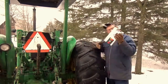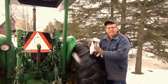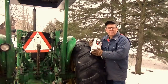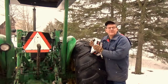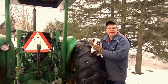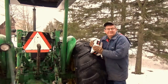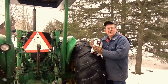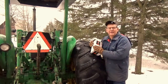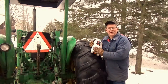So lo and behold we have another one. This one was shipped here from Alberta. I always buy locally and support buying locally, but I couldn't find the engine coolant heater I wanted locally. You see, this will be the fifth or sixth one of these I've put on this tractor over the years, and they're around $160–$170 at the dealer and they don't have a low wattage one. So I contacted the manufacturer and asked what am I doing wrong. He said just go to this chart. I went to the chart and instead of a 1200 or 1500 watt unit, I needed a 750 watt unit — a much smaller unit. I actually got this substantially cheaper online from a company in Alberta.